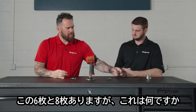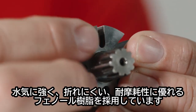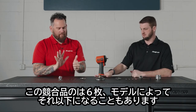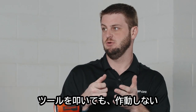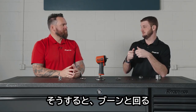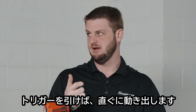I'm seeing eight of these — what are they called? Those are the vanes — that's essentially how the motor spins up. When air comes through, just like a fan, it pushes around and makes the motor move. We have eight vanes; competitors will have fewer, six in this case. That's important because with eight vanes you have less opportunity to be in a stall position where the tool doesn't want to do anything and you have to rotate the anvil by hand. With eight vanes it's going to fire up every time.